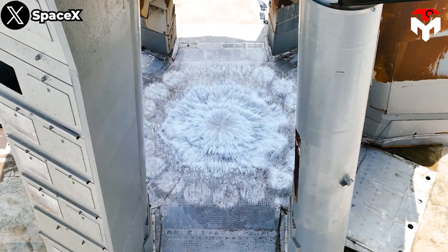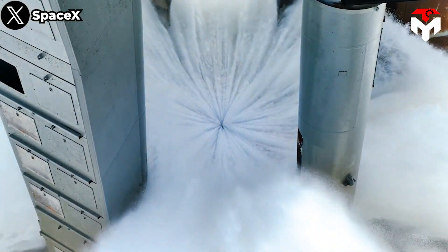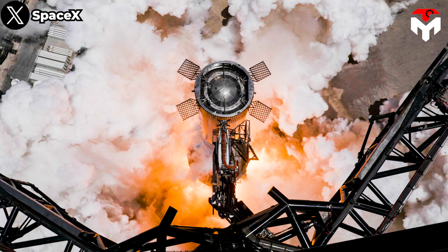This giant steel plate plays an important role in the flame deflector system. It is a very thick, perforated steel plate that sits directly underneath the rocket, with multiple huge water jets continually cooling it even as it is bombarded with flames from the rocket engines.